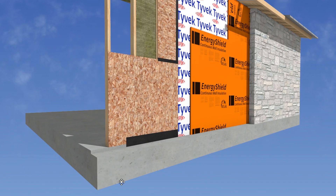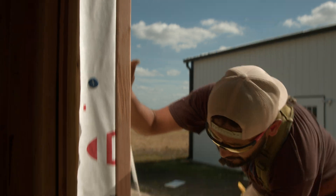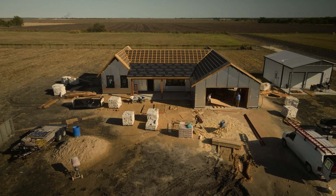There are many details involved — for example, if you make your wall thicker because of insulation, you have to change the way your foundation details work so that your stone sits on a stone ledge, you have an air gap, and then you have foam. You've got to make that brick ledge wider, or expand the size of your rooms so the thicker wall doesn't encroach on room size. But if you design it to be high performance from the start, it's easy to build it high performance without adding a lot of cost.